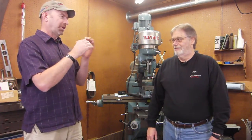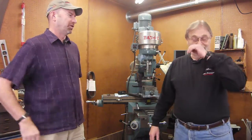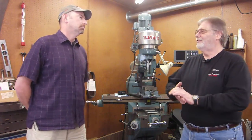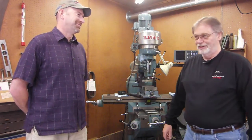Okay. Now, one of the things that's kind of interested me, I've never had any checkering done, although I have a gun with checkering on it. You machine the front strap to a specific radius, which then allows the checkering to all turn out perfectly straight and beautiful. It all depends on the tooling that you use. And I've done checkering with files by hand. I will never do that again.